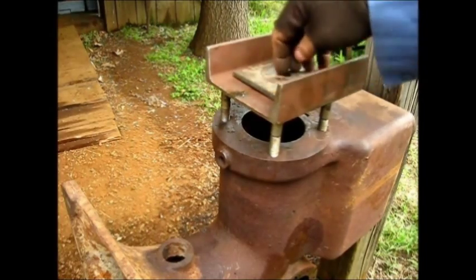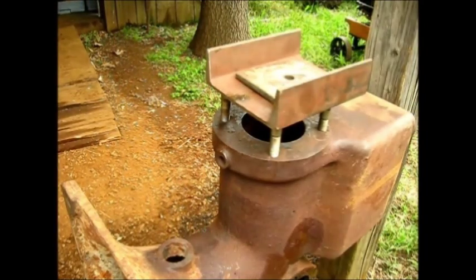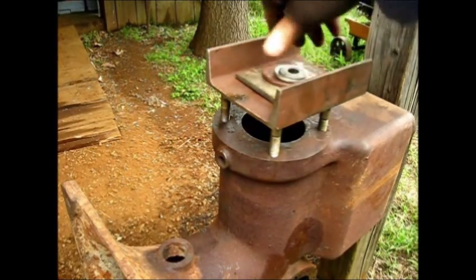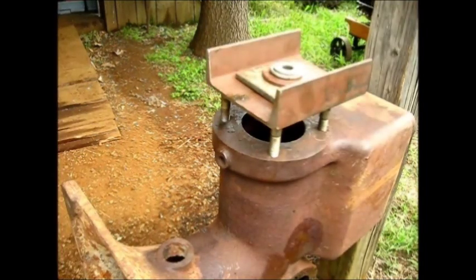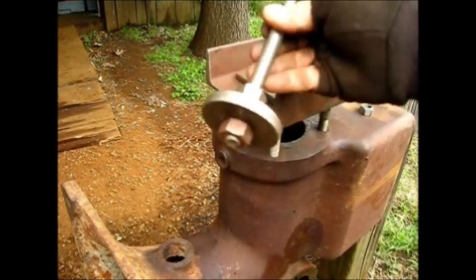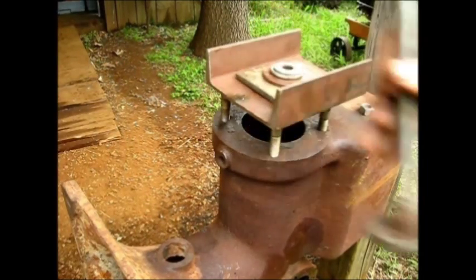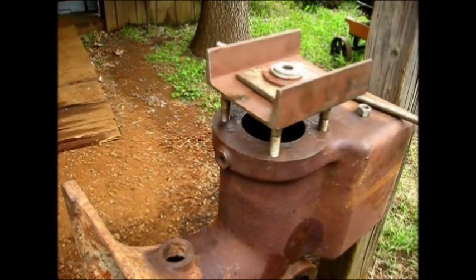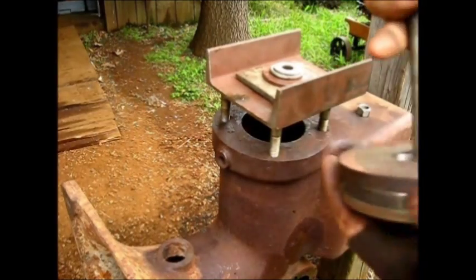I got another piece of flat stock to put there as support. Then you want to put three or four washers there so they will turn freely and you don't have a galled situation — put a little oil on them. The other end is an all-thread that goes from one end to the other, with about a three-eighths-thick round washer, a spacer, and a couple of nuts locked together on that end. I've got some spacer washers that fit against the back of the cylinder — the hole in the center is big enough to clear all of that.